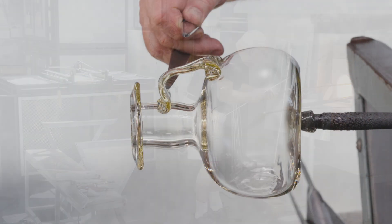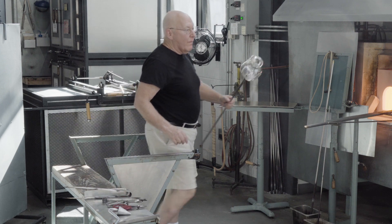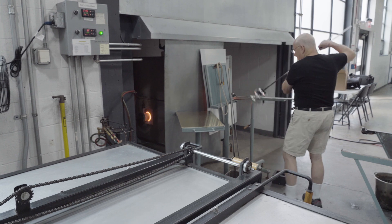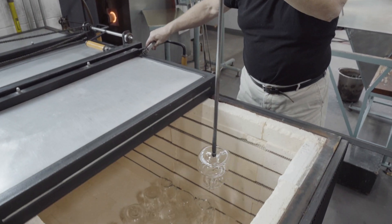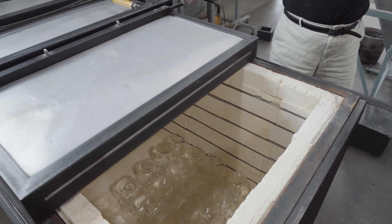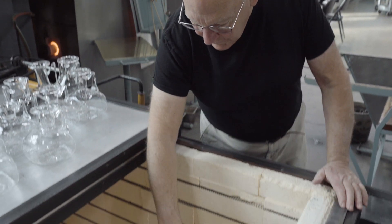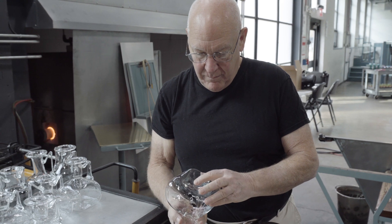The vessel is flashed in the furnace, and the handle given its final shape. The object is flashed a few times so that the handle and vessel body are the same temperature. It's then placed in the annealing oven, and the punty — the metal rod — is tapped gently with the tweezers, and this breaks it free. Vessels like this were indeed made in vast numbers, and it takes, in real time, about six minutes to make one of these objects.